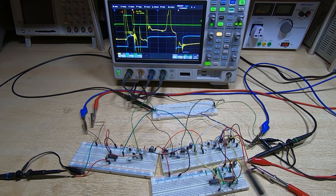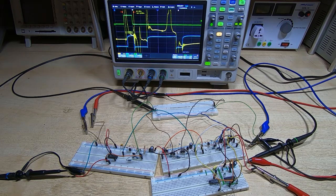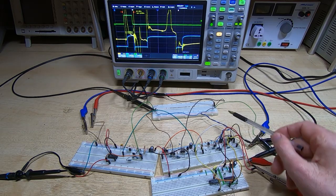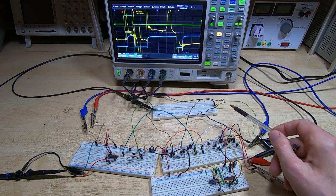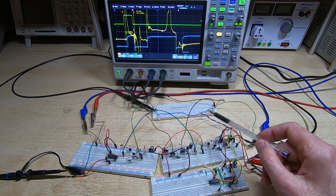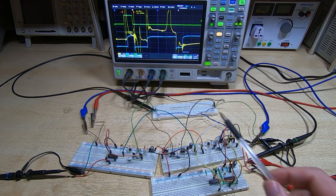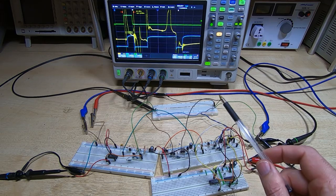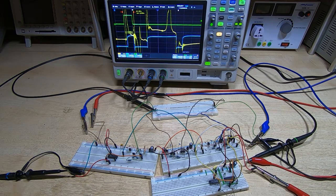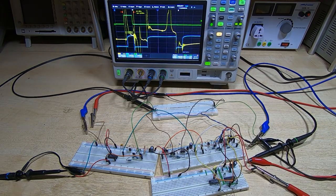In the next video we'll look at the main board. This is probably as far as you can go with breadboarding — it's very difficult doing this on a breadboard because of the high currents and wires that are really too long for this to work as it should. But even so it does seem reasonably stable. I can't really add much more without going to an actual PCB, so next video we'll get the PCB back on the bench, get that powered up, and start looking at it in more detail to see how the signals on that compare to the signals we're looking at here from the breadboard.